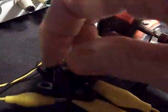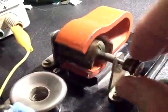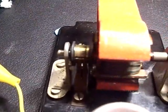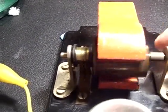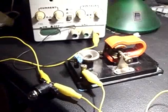For instance, if I put this thing in perfect balance and removed all friction, it would spin faster for a given voltage input. That's the basic tour of the little SEL in unrestored condition. When I've restored it and goosed it up a bit, it's going to run better. If you make it run better as a motor, it will also work more efficiently as a generator — making more juice at less spin speed. There are other things to discuss: how to recharge the magnet, timing of the brushes, and whether they're at an optimal adjustment. I'm sure I can make this thing run better than it does right now. It's a nice little machine — I hope you enjoyed the tour. Goodbye.